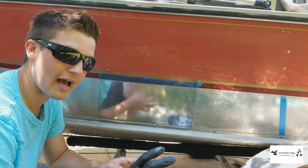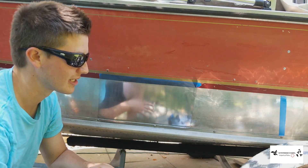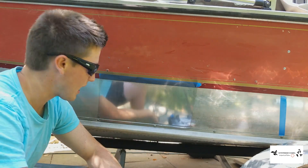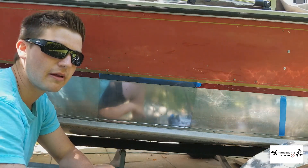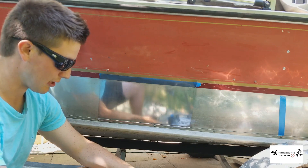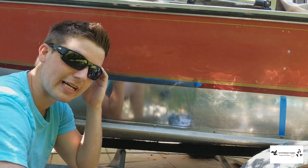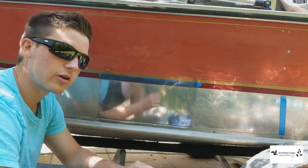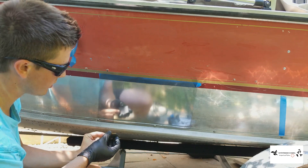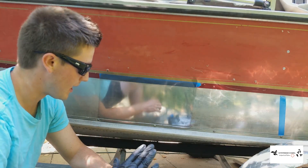If you have a dual action polisher, give it a shot — but in my opinion you need the heavier cutting pad. The other pads I have for cars are more of a polishing or light cutting pad because car paint is significantly softer than this metal. If you're doing this by hand, just clean up the surface, go over it with some 2000 or 2500 grit sandpaper, then take some 3M polish and you can get results probably just as good — it might just take a bit more time. One tip: when sanding, try to go in one direction. The easiest way to remove sanding marks is cross-hatching — say you sand at 1500 grit going one way, then use 2000 grit going perpendicular. That's how they do headlight restoration on cars to remove haze.